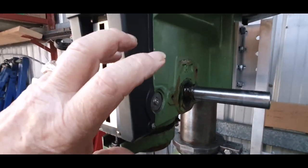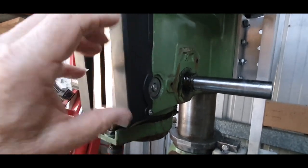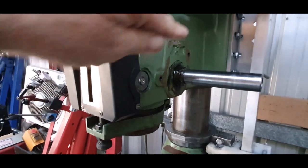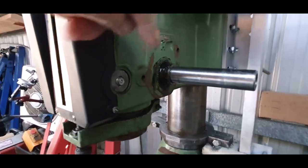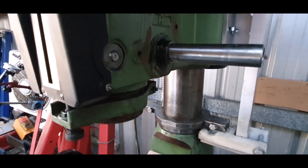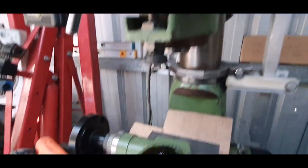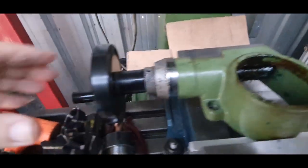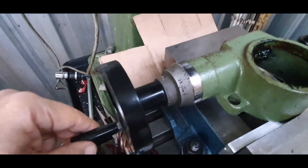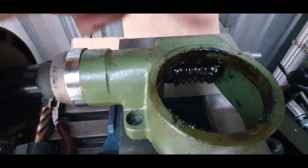As you saw, the quill wheel — the fine wheel that's up here — has got a worm that goes through there. And on here, you'll see the shaft of that, and that's got the other half there. So the piece that came off, that's this one here. That's your fine wheel adjustment, and inside here, that's your worm there.